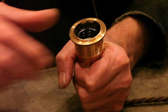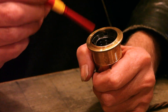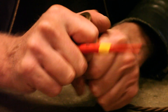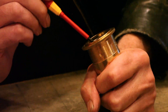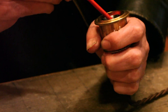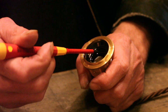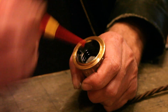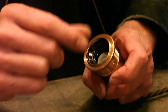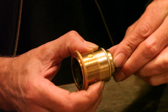If you end up in a situation where you've made a mistake - the cable's too long, the cables are on the wrong color - and you want to remove everything, you won't be able to undo this barrel again because it's locked with that ratchet. So if you do need to undo it, you need to find that little ratchet. You can reach in, peel that ratchet back inside, just bend it back out of the way and then everything will undo. You will need to push that ratchet - that little bent piece of steel - back again when you do it up.